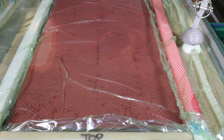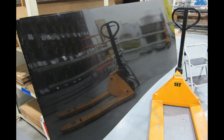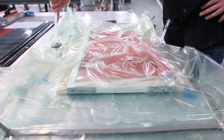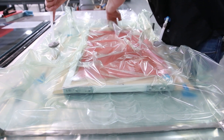This structure maximizes the part's strength. With resin infusion we are able to create parts with a large surface area up to 4 feet by 10 feet, and thicknesses from 0.03 inches up to 1 inch. Resin infusion is a clean process that separates the technician from the chemicals, and it is available in low temperature and high temperature resistant options.